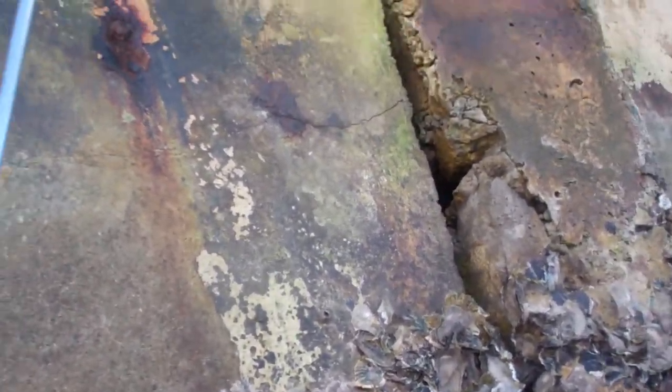You can see a footer that was poured in — somebody poured a footer to try and prevent movement — but the seawall is still loading very hard. There is a horizontal crack in the second-to-last piling. The last piling on this property is completely open, rebar is exposed on the cap, and this entire section needs to be reinforced — preferably with some tie-back attachments to reinforce the wall.